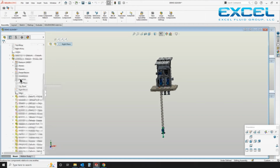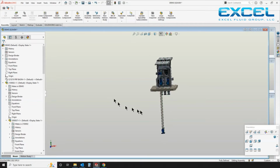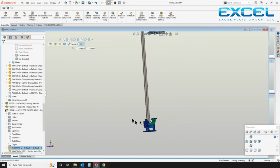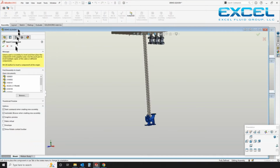So I'm doing the offset right now. Our 4-inch NV2 spacing is 26¼ inches. Half of that is 13⅛. That's from the center of the assembly. And you can see that's fully defined.